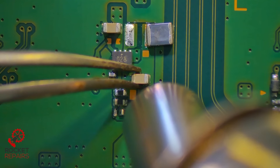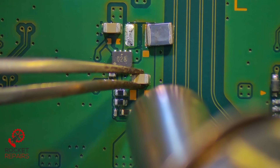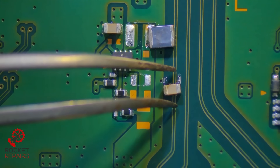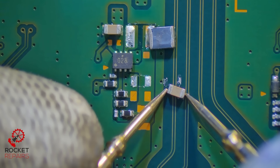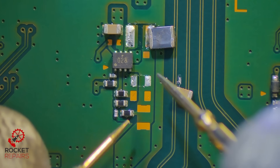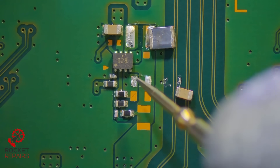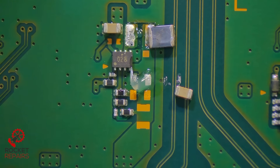I'm going to just remove this cap quickly. I'm being a little bit naughty by not using any flux, but in my opinion it's not necessarily needed right now. A way to test it is to put probes on both sides of this cap — and I'm not getting a short to ground now. So I think the cap is absolutely fine. This inductor is meant to carry current from one place to another, so that's fine. Do we still have a short here? Yes, we do — we still have a short on this component. I'll quickly take this off with a bit of flux to see if the short is still there.